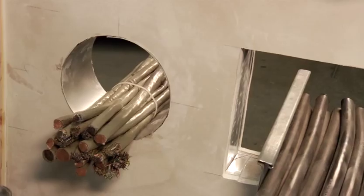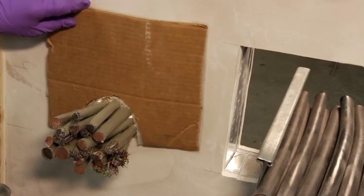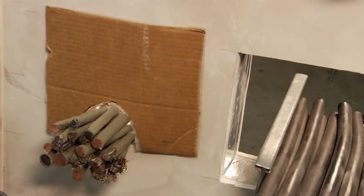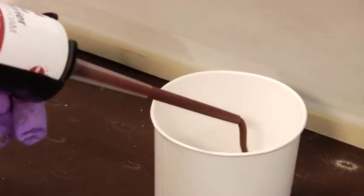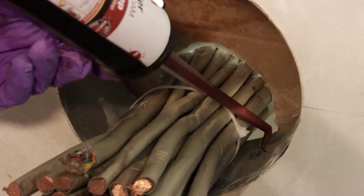To begin the process, you may put a cardboard backer behind the opening to prevent overflow foam from excessive expansion, but that is not required as part of the FIP One-Step process. Initially, drain the FIP One-Step into a disposable container until the FIP One-Step is a consistent maroon color within the mixing nozzle.